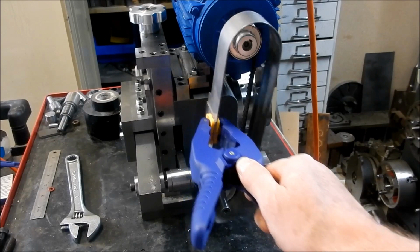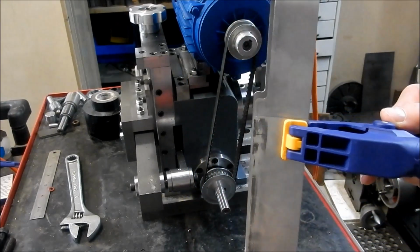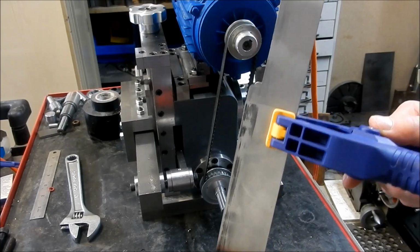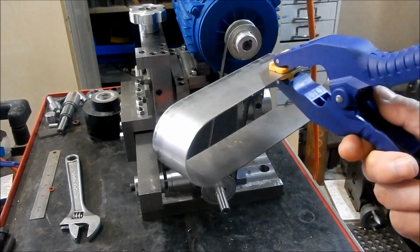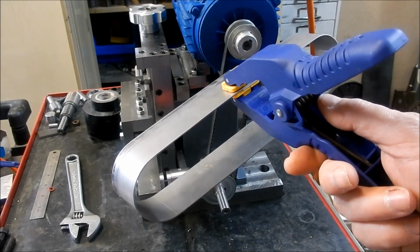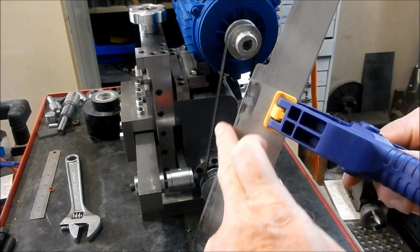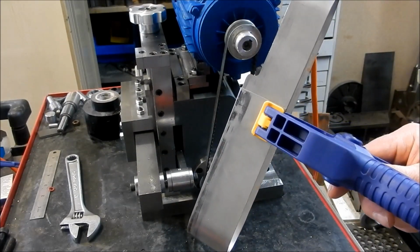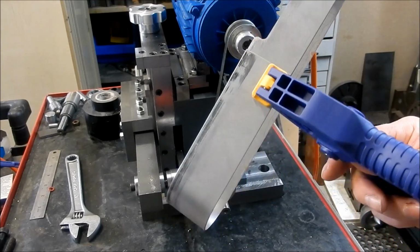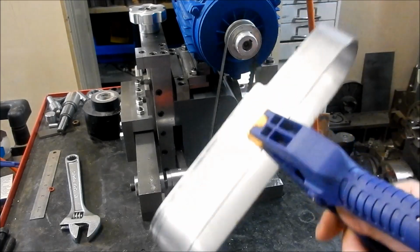Alright. What I'll do next, I'll just cut that off the length so it becomes a butt joint. Once we've got that done, I can pin it together with the clamp here, and then I can do the actual measurements to make up the cover that's going to get TIG welded into place. And we've got a foot that we need to put onto this as well to be able to bolt it onto the side of the housing. Alright, we'll get that on the go.